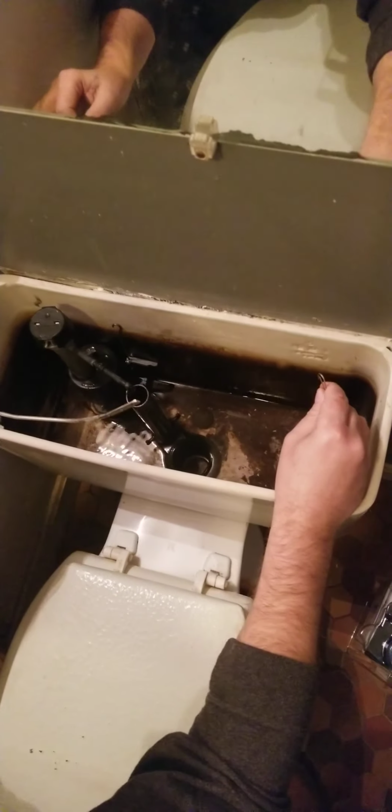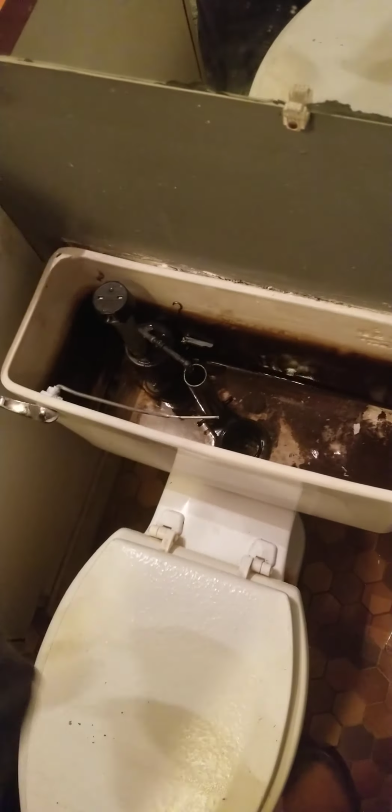I'm going to be popping this off. This is going to come off. We'll put a new one. So we want to drain that water out good. Now there's residual water that's going to be in there. So when I'm pulling this valve out from here, it's going to create a hole right underneath here. So I'm going to put a little bucket under here and catch that residual water. Or another way to do it would be to just get a sponge and sponge the water out. However you want to do it, but you want to disconnect underneath here.